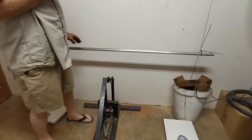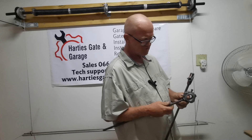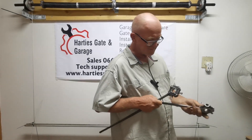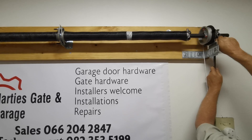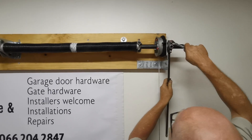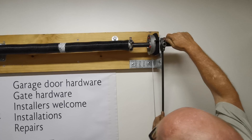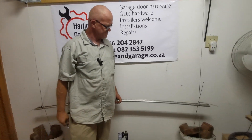The next thing is to relieve the weight of the door by lifting it up, but when you lift it the cable drums are going to operate, so you need to lock them up. I have these devices — it's simply a torsion bar tension clamp attached to a spring end. Make sure it's completely backed off, then use a bit of fabric tape and bang it in proper to lock up the torsion bar. Because this is a single-sided garage door, I'd do both sides on a double. We're just going to pop one on the end — now when we lift it, that torsion bar ain't turning.